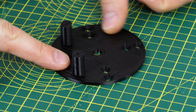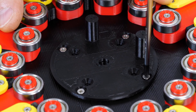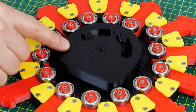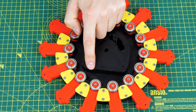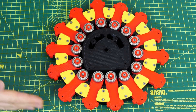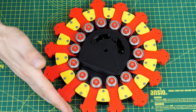The guide needs to move around though, so I've made a special base with two pegs that are going to constrain it, and that's screwed into the middle of the wheel. The guide itself has two slots which will allow it to move but not swivel all the way around, so it can comply with any slopes. It only moves in each direction about 20 degrees. It's flat at the bottom and that means all of the legs at the bottom will align with it and align with the ground so they can get traction in one straight line. It can also tilt so that it can drive up hills, and drive all those feet in a straight line up hills or steps in either direction.